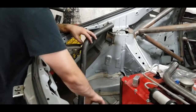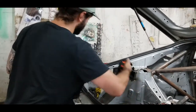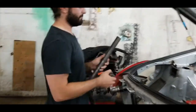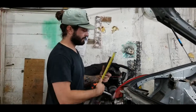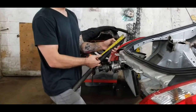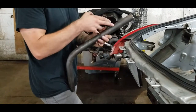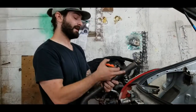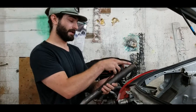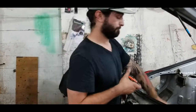Next thing we're going to do is rotate the tube 180 degrees from the apex, mark our 3 inches down, because that's the lowest point that this tube is going to sit on the flat bevel. And then we're also going to scribe that line all the way across and put another line in line with our apex, and we'll line that up with a bandsaw.